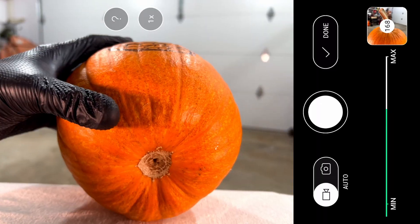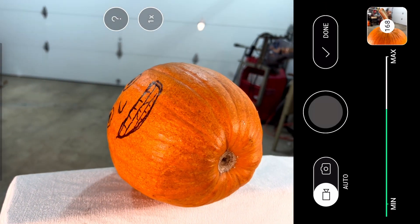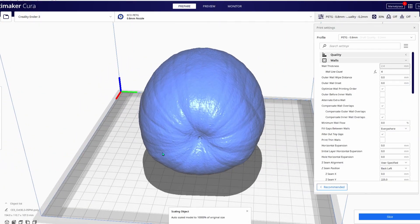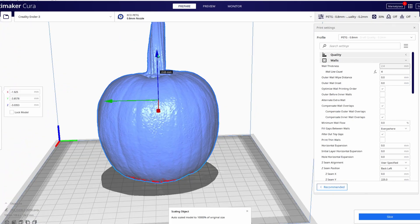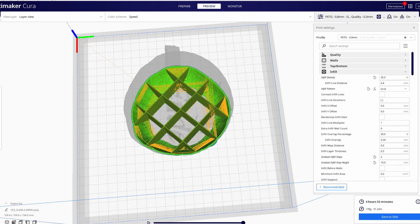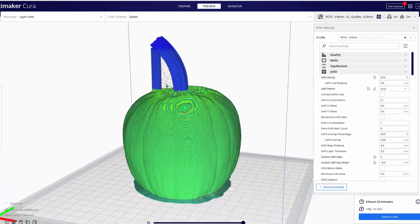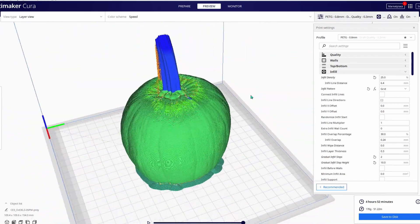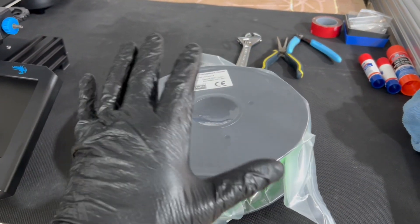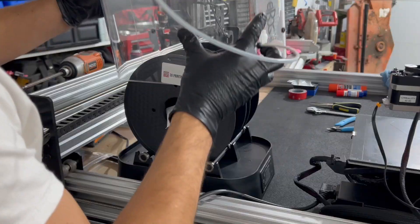And now the little trick that will make this so much easier to 3D print: move your object so the bottom can be scanned. Doing this will allow the software to close the object completely, and it can then be brought into your printer software with no modification required. For this example, I'm trying to avoid printing with supports, so I will shift it down in the Z to start completely flat. I honestly have not spent much time on the settings for this video — I'm printing this more to see how the scan looks in the print. This is a really quick print with a 0.8mm nozzle. For the filament, I think I'm going to try this transparent green PETG. This is pretty awesome stuff — I think it's going to suit the Halloween theme just fine. But I do want to dry this just a little bit, even though it's been packaged up, in this dryer that I have.